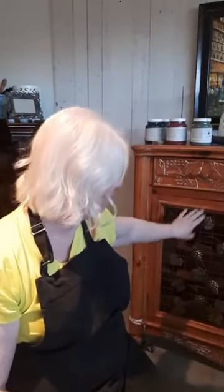These I'm taking off, so it just needs a good wash down. What I use is a product called TSP, I think it's trisodium phosphate. You can get TSP from your regular hardware store, and if you use that, wear gloves, and make sure you wipe it all down with water after you've used the TSP. But I use Fusion's TSP, and I don't know what they've done to it, but it's a TSP that's safe. Once you've wiped down your piece, you don't have to do any extra step of taking it off again. You just wipe it on, take your dirt off, and the rest of the TSP just sits there for painting.